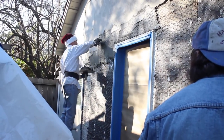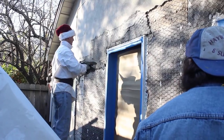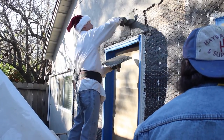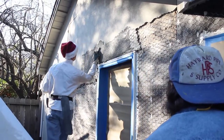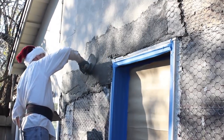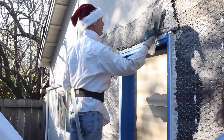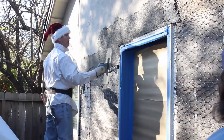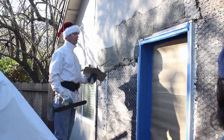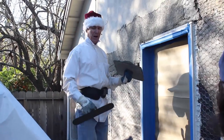Any of you plasterers watching might wonder how that much mud stays up — normally gravity would pull it and it would fall on the ground. The reason it isn't is because I put extra wire. As I'm doing this I'm putting the trowel on edge, not flat. Putting it on edge opens the circle so it can breathe and stay even if it's thick. If you close it off, it won't get any air and could just fall — about 50 pounds on the ground.